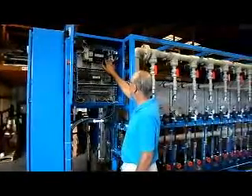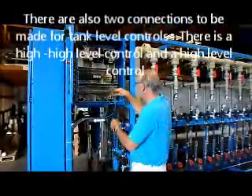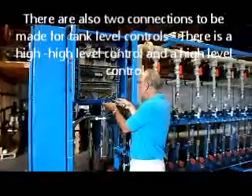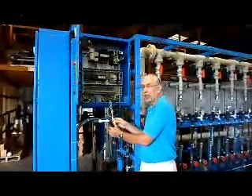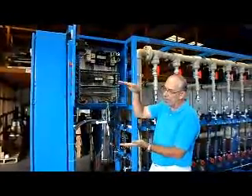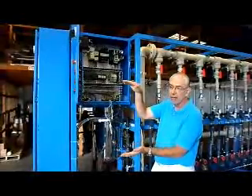In addition to the power supply into this panel, you will have to make some connections for some closures. I have some here that I've just simulated for demonstration purposes. Like with the case of the RO system, the design is for two floats — a high-high in the top of your product tank, and a high a little bit down from the high-high.